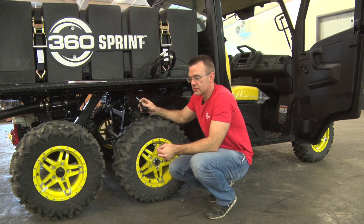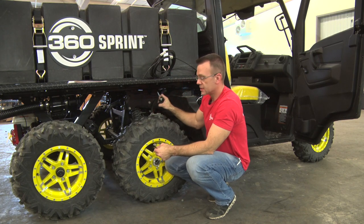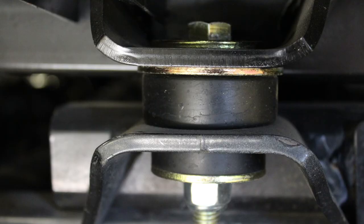Now that you've got your linkages installed to the tank and frame, it's time to isolation mount the tank and frame to the gator itself. Follow the steps, step 7D, I believe is the one. It'll show you the layout pretty clearly, each piece of this isolation mount. Leave your isolation mount assembly loose and then go over and do the other side.